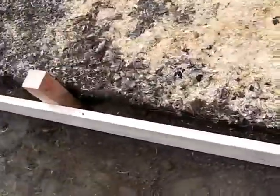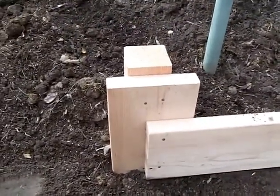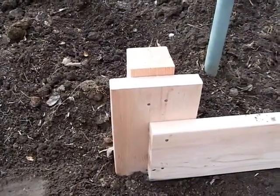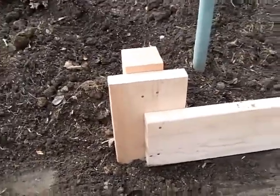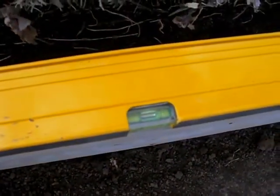Now I'm going to have to backfill this. On the very end where I'm going to have a seam, I actually took about a 20-inch hunk of the extra two by eight, cut that off, attached it to the four by four, and I'm using that so I have more surface area to join the seams together. Believe it or not, everything is level. I don't necessarily need it to be unless you're just looking for aesthetics — it serves no utility purpose as long as the soil is level or pitched whichever way you want. But we are pretty level — I just got lucky on that.